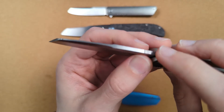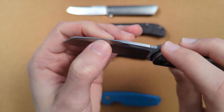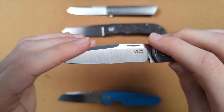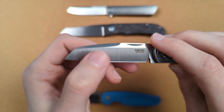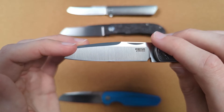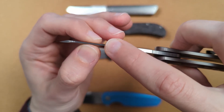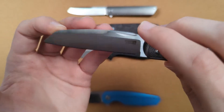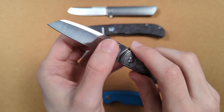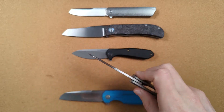This part back here on the knife is called the flat, and it's the full thickness of the blade stock. On this knife it's 0.12 inches. And as long as this flat extends forward — you can see from the reflection it's coming to right about there — the knife stays at that full thickness, 0.12. But a lot of swedges are angled downward, which means they cut into the primary grind. By definition, the primary grind is thinner than the flat because material has been removed. So the further you come down into that grind, the thinner the blade gets. So up here we're at 0.12 all the way out, but this blade actually thins out down to 0.09 — that's a full 25% decrease just by coming down that swedge. It means it's easier to cut through dense materials up here where it's thinner, but it leaves you with the full thickness and all the strength behind it if you need to push through something a little bit harder.